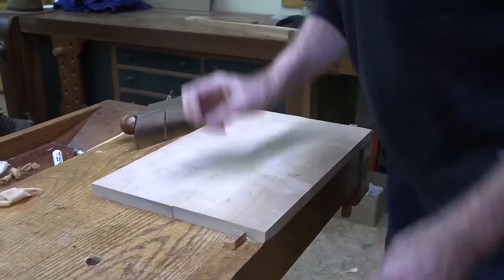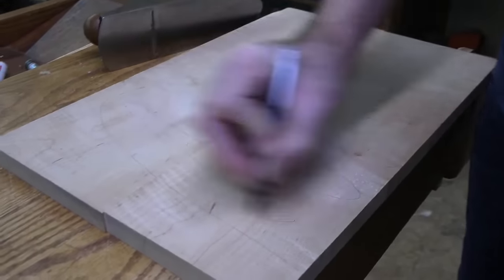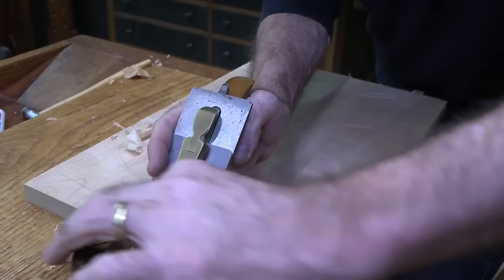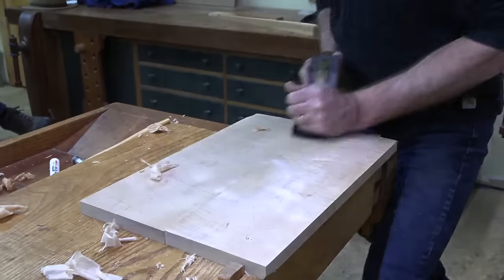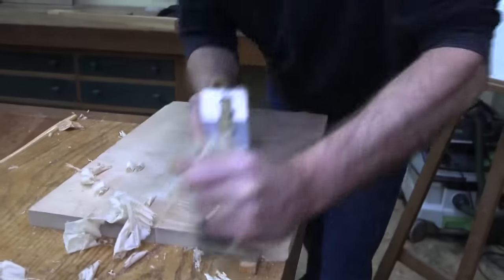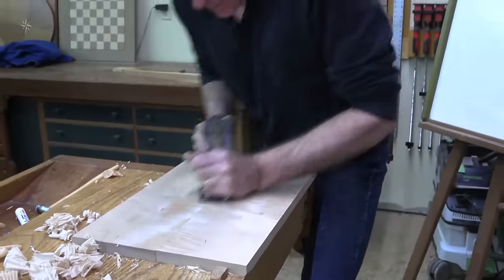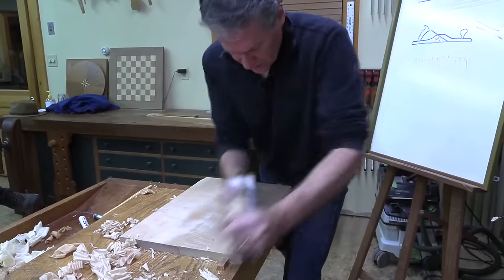I'll put a pen mark on there so you can see what I'm doing. I've got to look where the shavings are coming out - they're a little off center to this side, so I'll push the lever over there and check it again. I've got it set light and I can feel the wax on the sole just gliding this plane along. That's doing a sweet job. I'm not getting much tear out at all - I can see a slight bit that would probably not exist with the other plane.